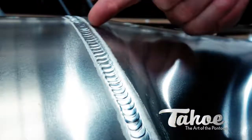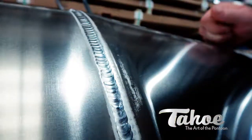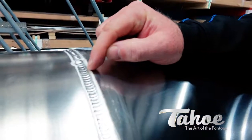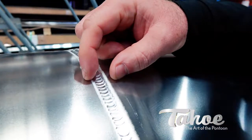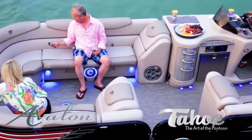You don't see any defects, there's no pinholes, there's no cracks. The dimes are laid in a nice stack. You're looking for a good solid weld that has good penetration on both pieces. You're looking for even stacking, you're looking for no cracks and no pinholes.